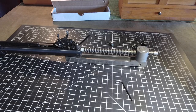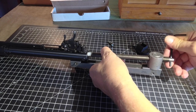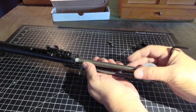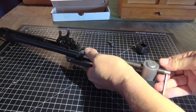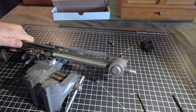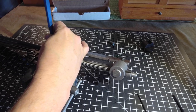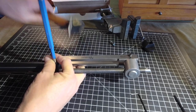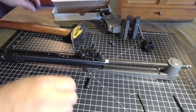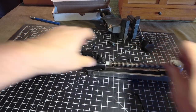The next thing we're going to do is use the allen key as a handle to turn our compressor and line it up against that end cap, easing it in a bit. That should allow us to push the cross pin through pretty easily. I should be using a wooden block for all of this, but in the middle of recording I don't have enough hands for that. Go ahead and pull that pin out. The cross pin is now out and the spring tension is being held by our compressor.